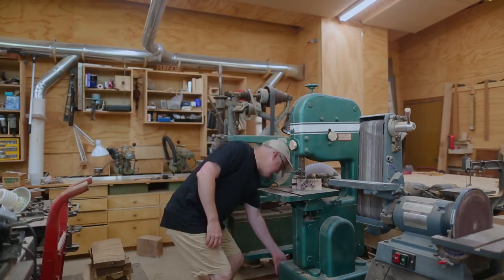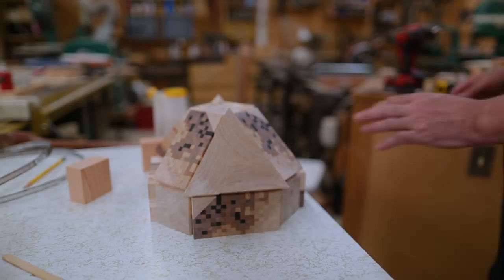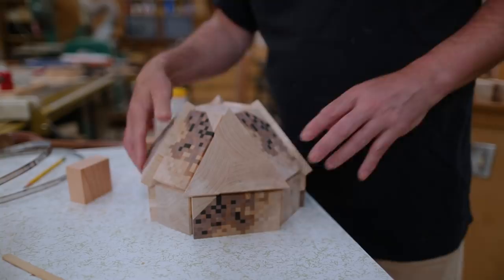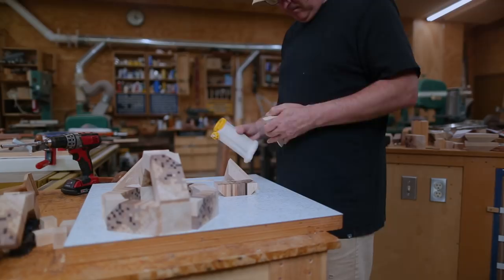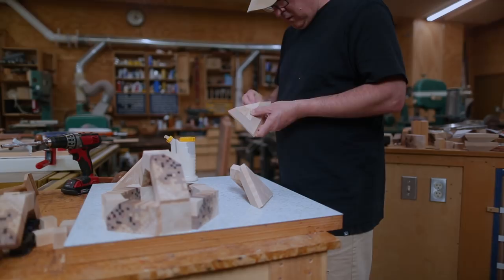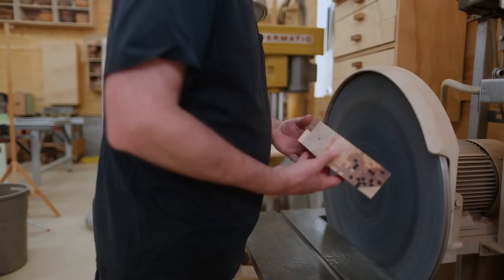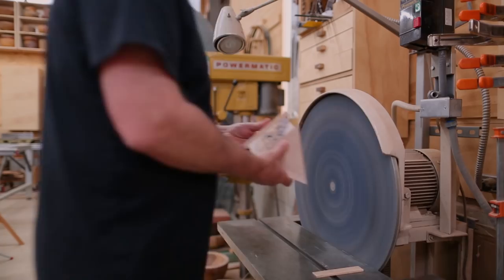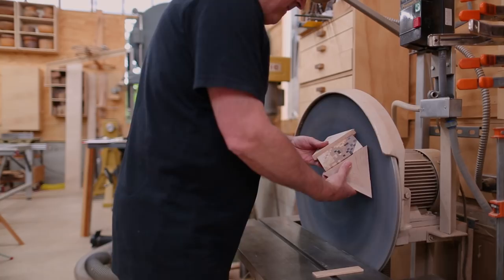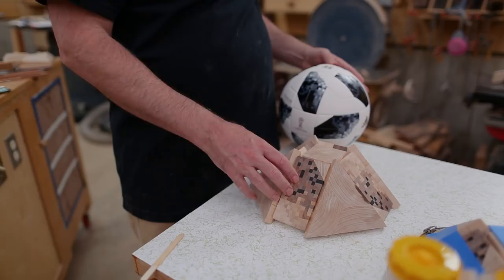You can see how the triangles fit in, and it was tempting to just glue them in like I'm putting them in here, but what I really need to do is glue this up in sections. To make the third ring and start putting the triangles in, I glued up each quadrant by itself — so there are sort of three pieces: part of the ring, which is the pattern piece, and then two of the triangles. Then I can sand the sides of the second ring — they don't need to be sanded much, just made flat. I can sand the sides of the glued-up quadrant as well. In doing it this way, I can worry about one glue joint at a time — glue in one dimension instead of two dimensions.